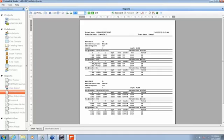In this case, we're going to have 2 holes being drilled side by side, one at roughly 1 inch out, one roughly at 3.5 inches out from the back edge of the die. We're going to drill through to make sure we pierce through the walls to a depth of 3/8 of an inch. This is something you can set, how deep you want the drill to go. We've got a limit set so the drill doesn't go through the back side of the die. We're going to limit it to go no more than 1 inch if it was going through. We're drilling through the top edge of the die. The machine will drill through the top, the bottom, or the front side of each of the dies.